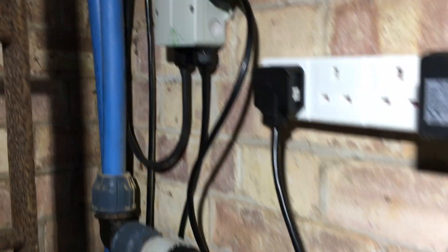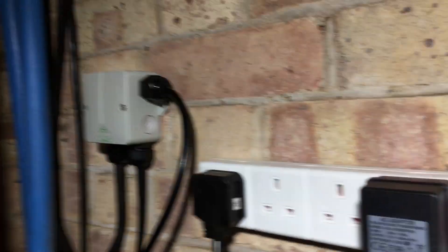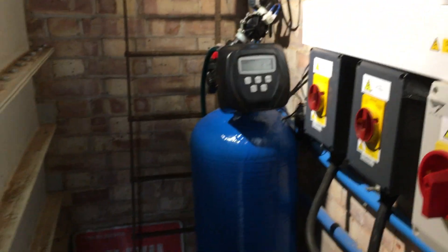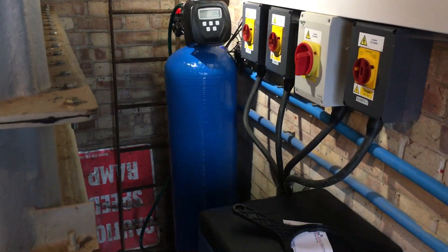We operate it off the borehole pump — a little box of gubbins with a power supply — and it jumps off into the tank. We've now achieved a very nice 100 ppm hardness down from 420. We don't want to go much lower because the sodium level goes too high.